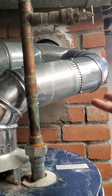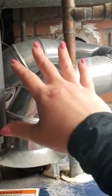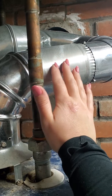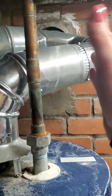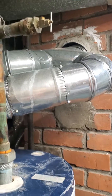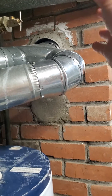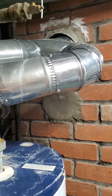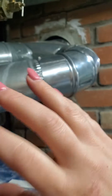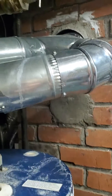When you have both going out of the same chimney, the lower BTU unit needs to come in above the higher BTU unit. I always use the analogy that the furnace is like a Mack truck and the water heater is like a Mini Cooper or Prius — that big Mack truck with how much heat it puts out just hogs the road and it's never gonna let the smaller BTU in. So the lower BTU needs to come in above the higher BTU unit so that the higher BTU is actually creating a draft that pulls the lower BTU up with it.